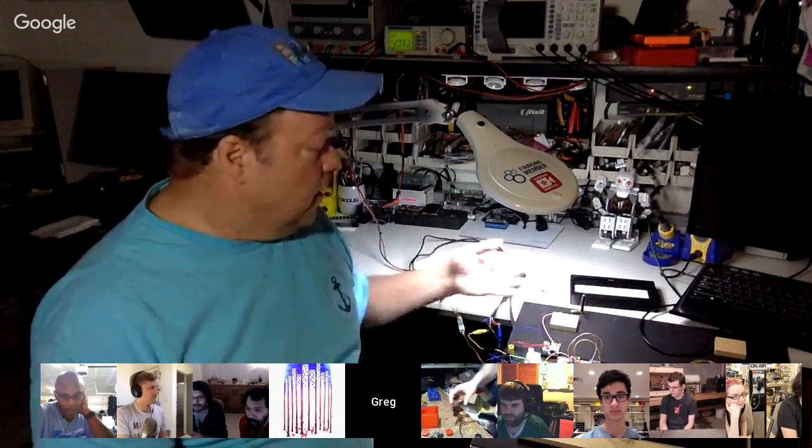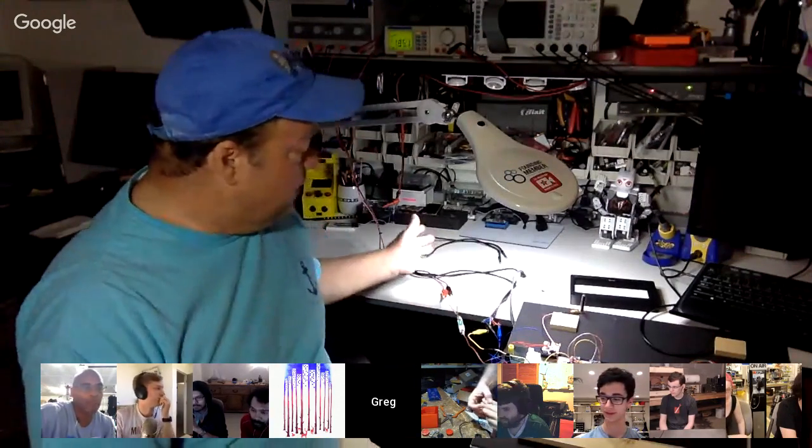I'll be using the ESP32 Wi-Fi. I just got it today, so this prototype's on the M0 Express. And I've got a whole bunch more telemetry that I'm pulling out. I've got the BME280 for humidity, temperature, pressure, the SI1145 for UV index. I'm using the Fona breakout board as a failover if the Wi-Fi is not happy for some reason. A float sensor for water incursion in the boat, and some voltage dividers to monitor the banks of batteries on the boat as well. Everything's powered through a buck converter, which takes the boat batteries down to 5 volts and powers everything up. The Feather's got the level shifter to pull it down to 3.3.